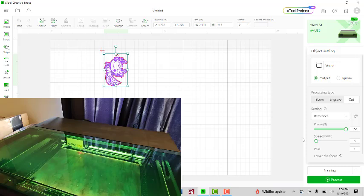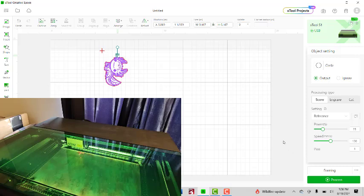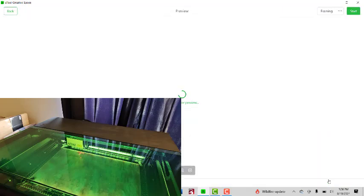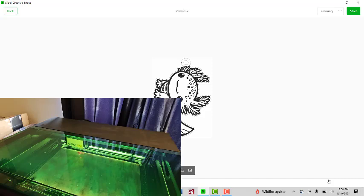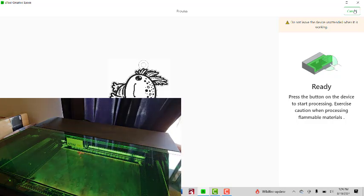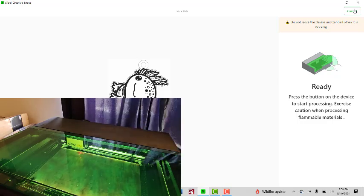We're going to see if the black settings work on this acrylic and make sure you get every piece. You can union all these pieces together if you want them to go together, but the little hole in the keychain and the outside of the keychain were two separate pieces, so I had to make sure they were both good. My next step is to hit Process, and then this screen comes up — preparing for preview. There's what it's going to look like. I click Start. I haven't put the hose out the window yet, so let me take care of that. I do not want acrylic fumes in this room.